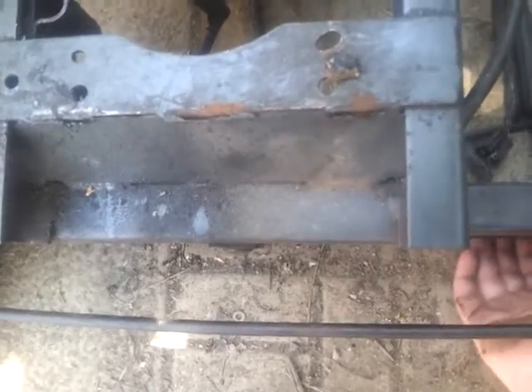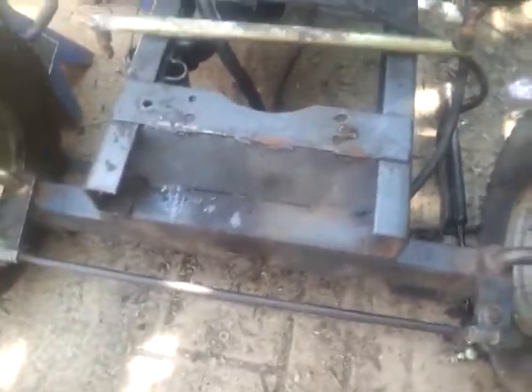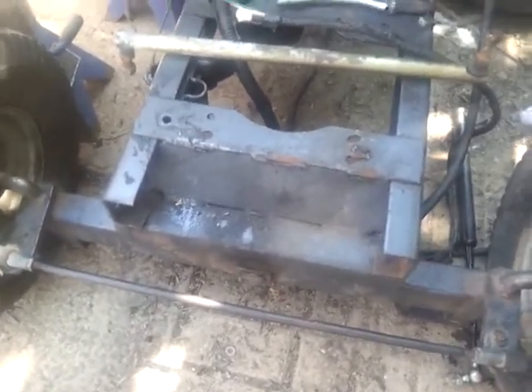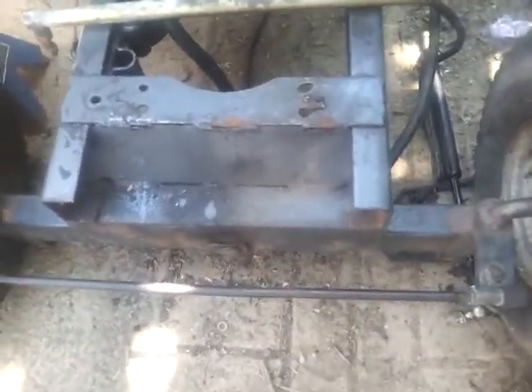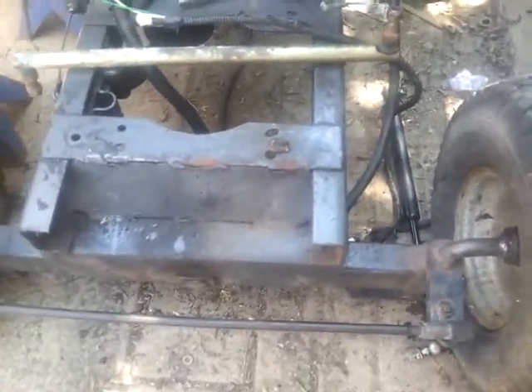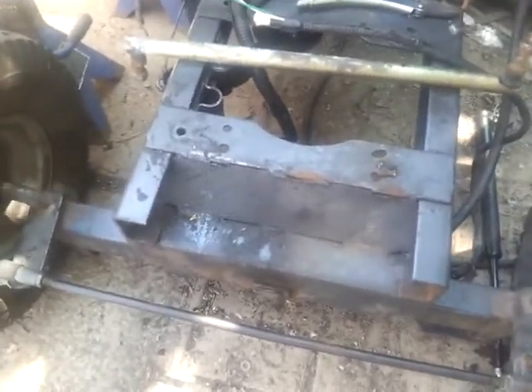Let me show you back on the Kubota. On the Kubota, on the other hand, it's a greasable front end — there is a grease fitting at the back now, it would have been at the front but now it's at the back. And on the bottom, it's a full welded piece — the actual whole rod is welded right in there. That's why they give you a grease fitting. They're serviceable by greasing them, but they're not serviceable by being able to replace these spindles. These spindles are the same size going out to the tire — it's solid. On the Craftsman ones they taper down. So this is a much better front end.